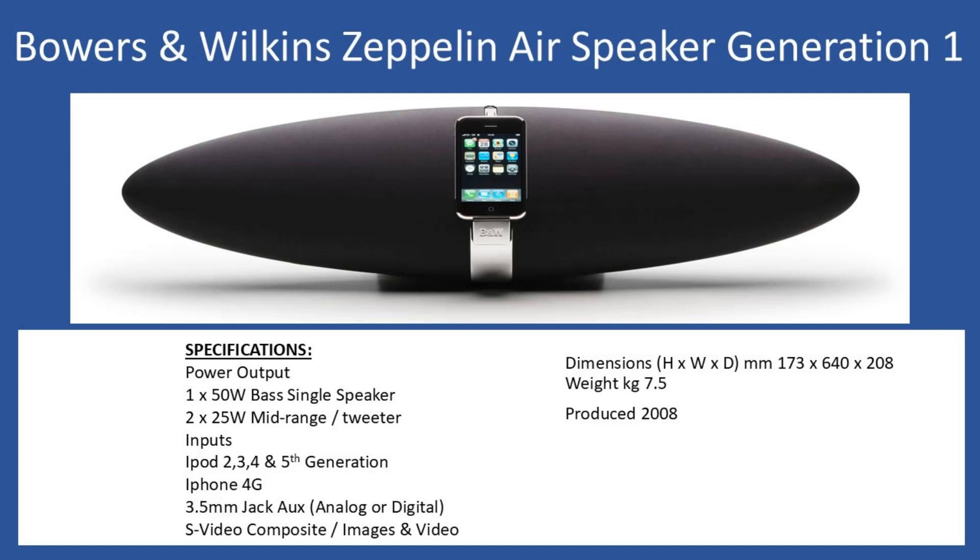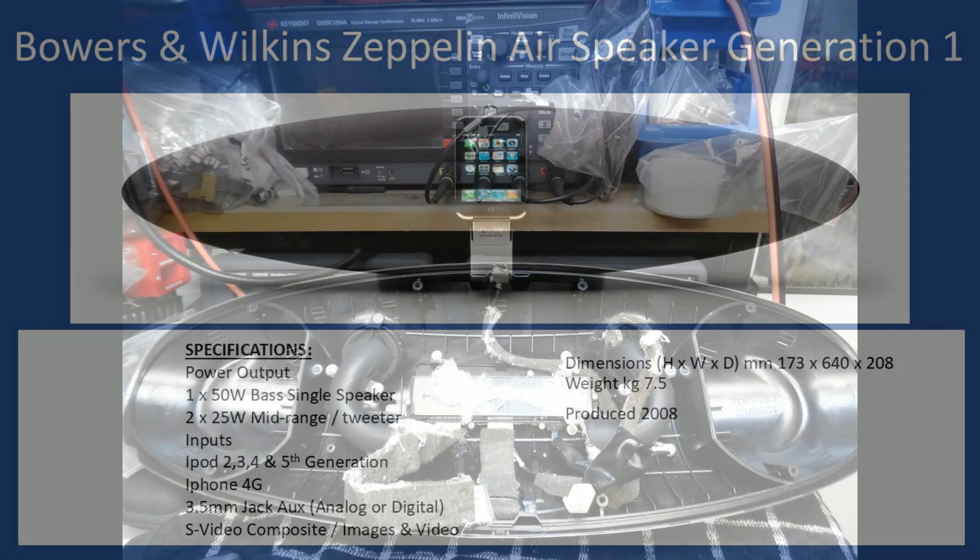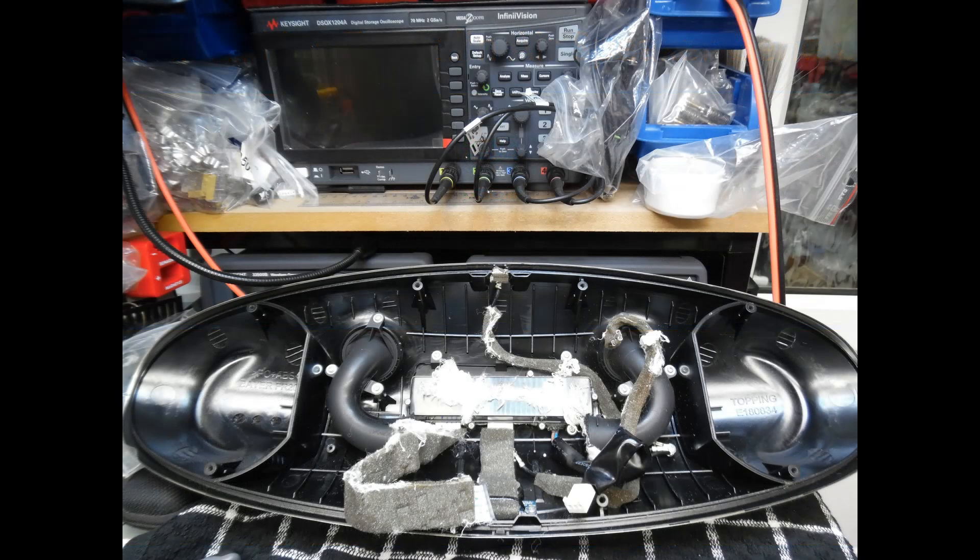When the mat is removed you'll find security torx screws underneath. Turn the unit around and there are multiple screws which secure the back and front fascia together — it comes apart like a shell. What I'm showing here is the rear, and you can see lots of white acoustic foam wadding, which is normal, along with pipes at the back transferring audio and a series of multi-ribbon connectors.